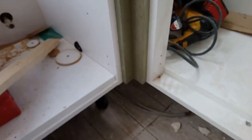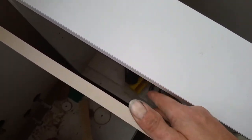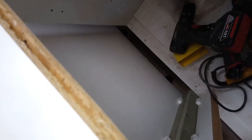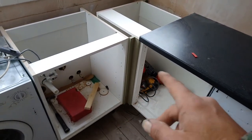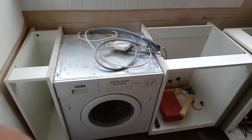I put this the narrowest distance there because I wanted the maximum there. It's basically little connector blocks that hold it on the face. I'm going to do the same thing with this end panel — little connector blocks top and bottom — so when I'm inside there I can unscrew it, drop it down, slide it out of the way. If you don't have pipes and straight walls to deal with, you could just put the unit together and shove it into the corner, then put your next units in.